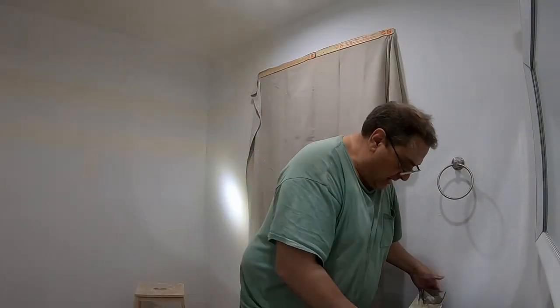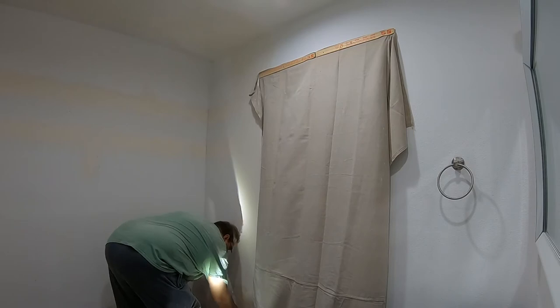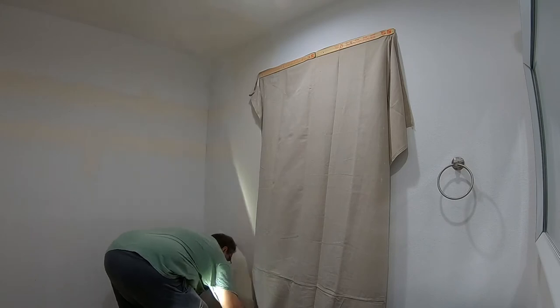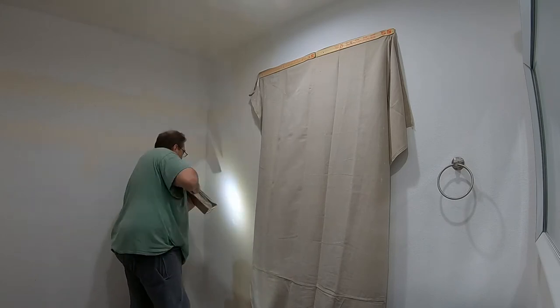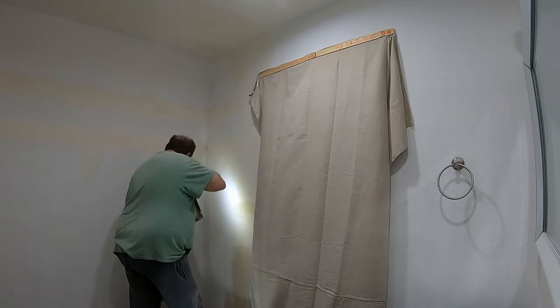Just because I forgot — one of the things I did is I put a little water in this time to thin it out even more, because I'm really now doing the final coat and I want it smooth and thin. I know I'm calling this the final coat, but it really isn't going to be the final coat in most places. I think this makes the mud smooth enough on about 80% of the area I'm working on, but that other 20% is going to get another coat.